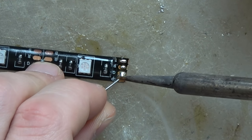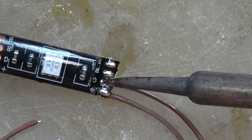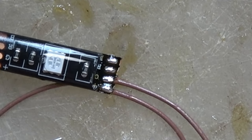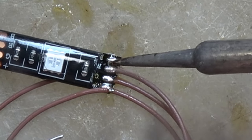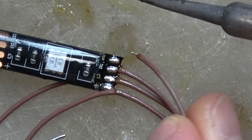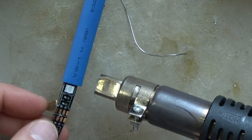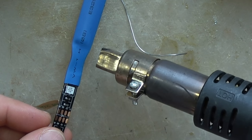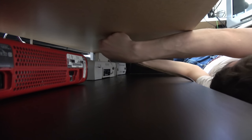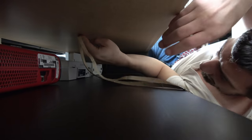I had to do this eight times because I have eight bends in the setup. You don't necessarily need to do this if you're just adding LEDs, but I wanted nice clean bends. On all these LED strips there's a plastic film on top — you have to peel it back to expose the solder pads, then snip it. I also threw some shrink tube on the connections, though I skipped it on a few since they won't ever be touched again.